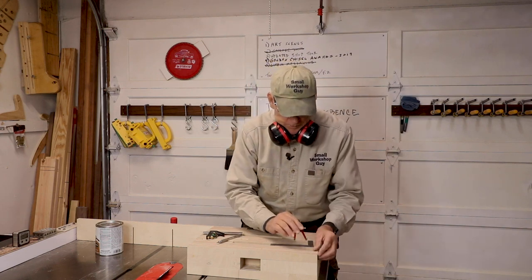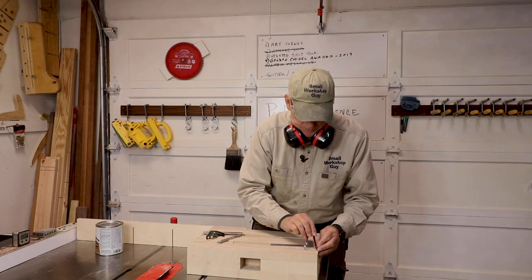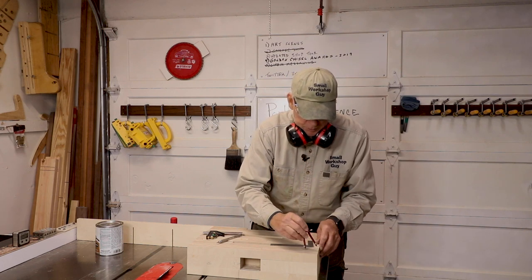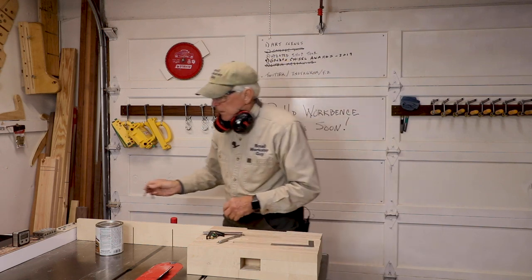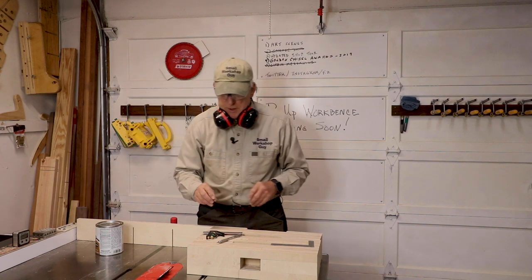So again, come out whatever the distance is, go down whatever the distance is, then do an arc from there and an arc from there, and then put the point on the arc and do your circle. When you drag a compass, kind of lean it and drag it. All right, but that's a big hassle. You probably won't know where you put your compass.